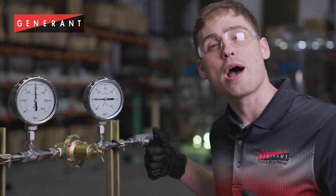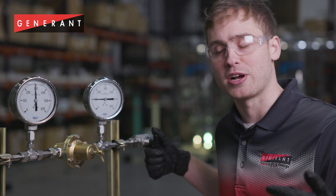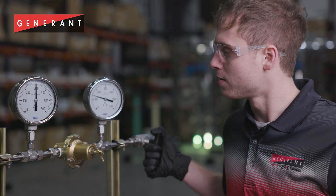But when I close the valve, the outlet pressure begins to rise to inlet pressure. The leak shown here is severe, but this condition could occur over hours or even days if the leak is smaller.